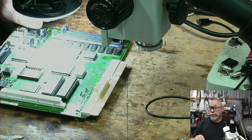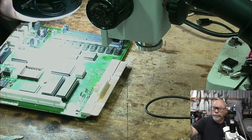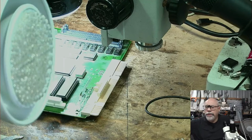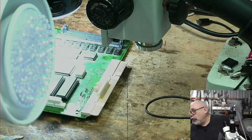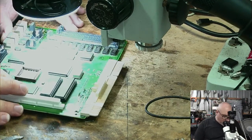Then, of course, it does need to cure as well. Now, if the sun is beaming outside, I can put the board in the sun and I will generally get that cured within probably 5 to 10 minutes with the sun on it. If I have to cure it inside using my little UV lamp, which is here, you can't quite see it, if I switch it on, you'll see some glorious UV-ness. There's UV, yay. And that UV lamp takes a lot longer. I'd probably let it at least half an hour to cure that stuff. Okay, so that's just explaining when the UV mask goes on.